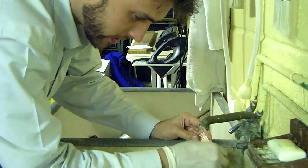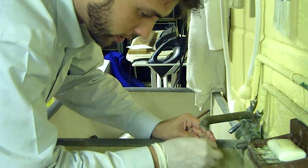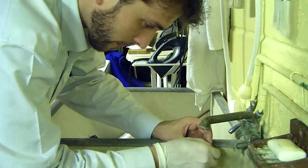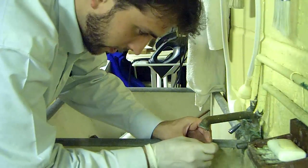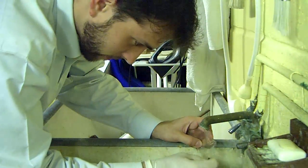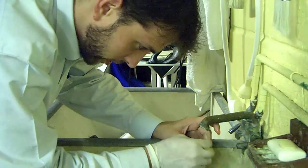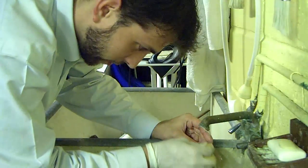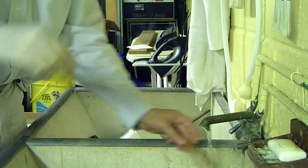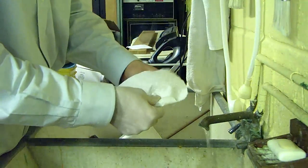The other thing to note is at this point in the process we can no longer use any alcohol or acetone or anything else, because the UV glue is very susceptible to corrosion from just about anything. Almost done here. Just wiping off the last little bits of the toner transfer stuff. Actually, it's straight up toner at this point. And so what you'll notice is that there are black spots still while you're wiping the stuff off. And these black spots will slowly go away as you continue on wiping. And if you look at it after a little bit, there will be basically no black spots left. You want to do that under running water too, so that it immediately takes all of the toner off. Once done, just stamp it down with a paper towel. Again, try to avoid touching the copper at this point.